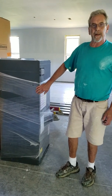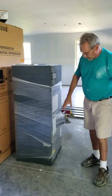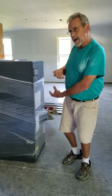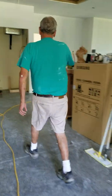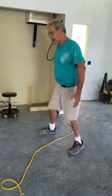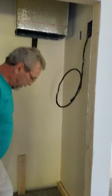This is the platform for this air handler — the air conditioner is up-flow, so air comes out up here. We have to build a platform to set it on so that it can suck air underneath it. This is the closet it's going to go in — that's where your air flows up into your plenum. And then you've got your line set that connects it with the condenser outside.